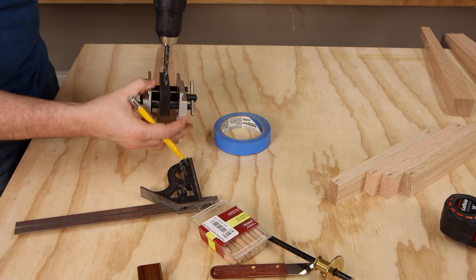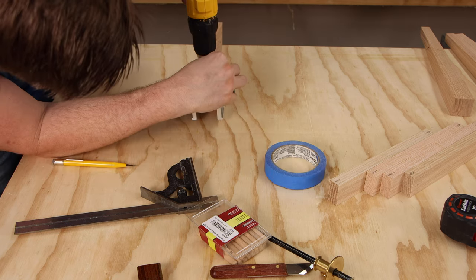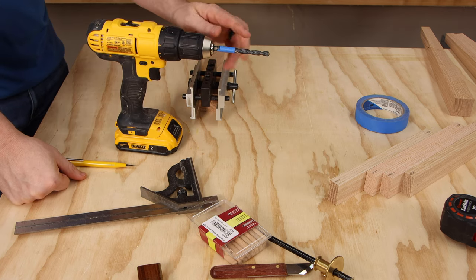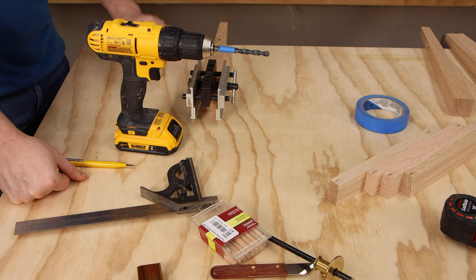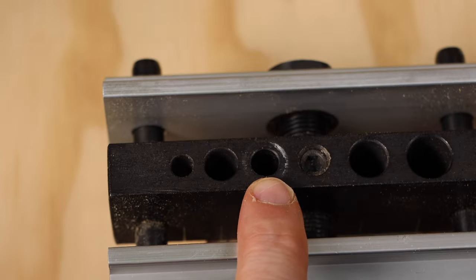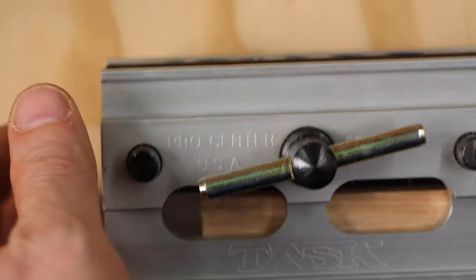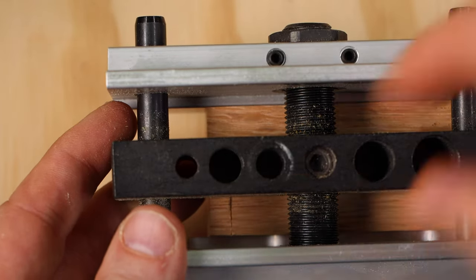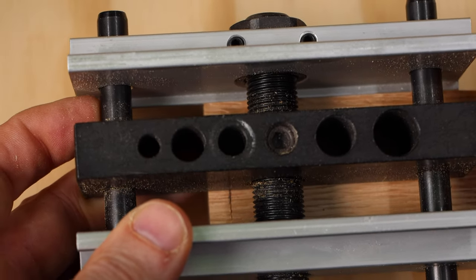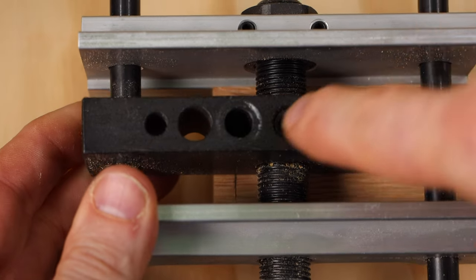I've made my mark and need to measure with the jig in place since we're drilling through it, so I'll set this overhanging the end. Every hole gets this depth except for the ones in the middle of the front and back aprons, which we'll deal with later. Now I line up the 5/16ths hole on the jig with the marks on the leg, slide it over until it's lined up, tighten it down, and then it's secure and stable to drill.